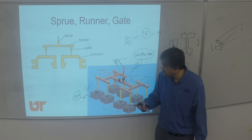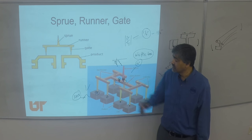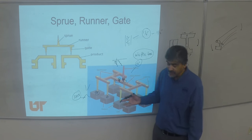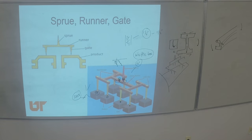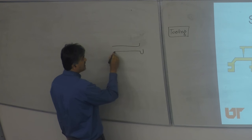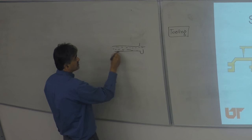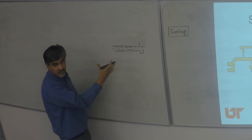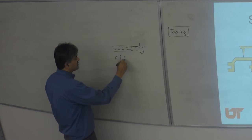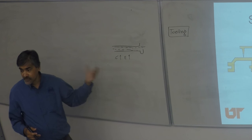There are a lot of detailed design changes that have to be done when you migrate fiber-filled polymers into an injection molding cavity. But the advantage of getting fiber in the cavity is very significant — the fibers will directionally align in the direction of flow, and therefore your strength and stiffness properties will all go up in proportion.